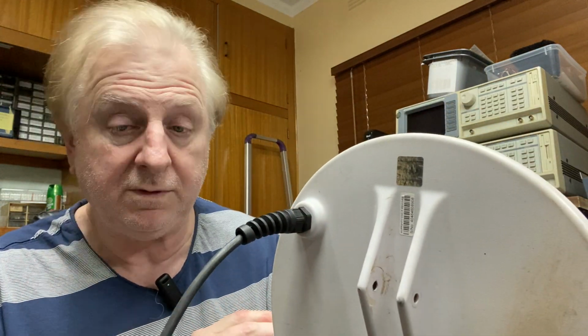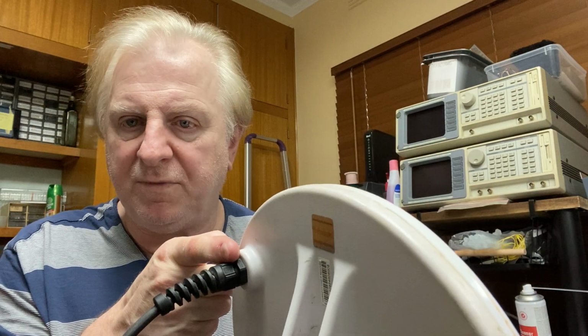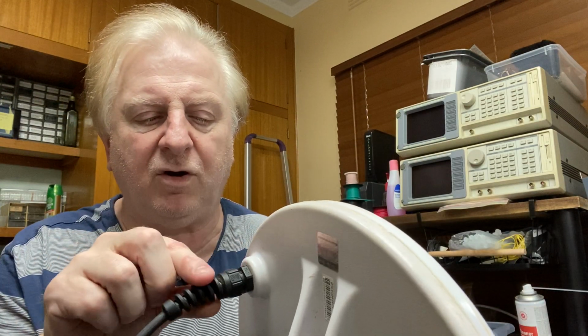It depends. If it's an old coil and it's not doing much, it'll still work on the detector. In some cases it will, some cases it won't. You can break a lot of strands off. Like when I was saying, with this system here with the little rubber bung and the concave convex parts that squash down like crazy on it, and then this moves a little bit and it starts breaking all the braid strands, and the coils start not working as well as they once did.